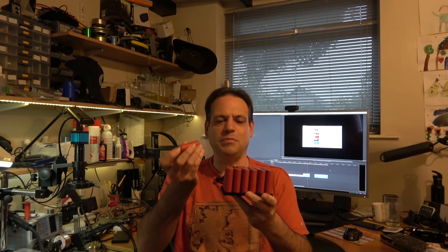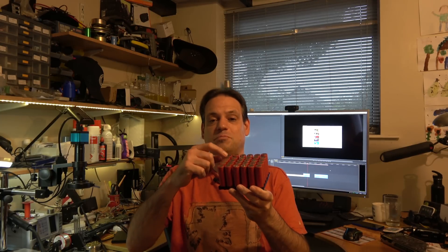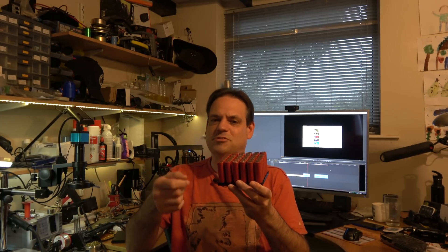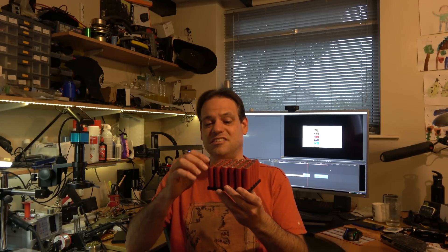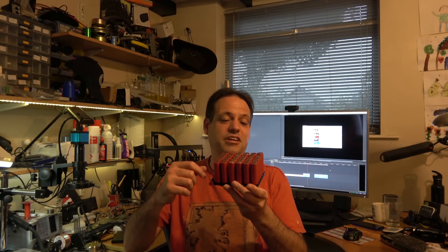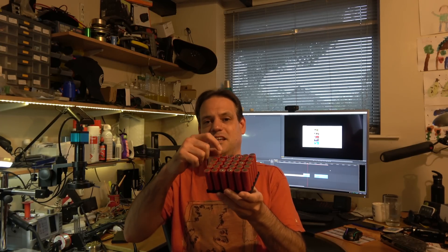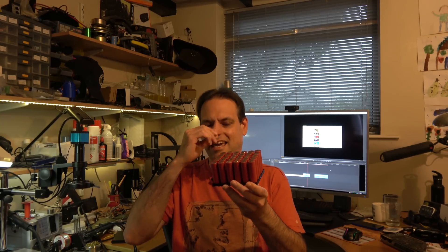Hi folks, it's been a while since we've had a proper project on this channel. For the last year or more I've had this set of lithium ion batteries kicking around on my desk, and I've been promising I'd make them into a proper 12 volt battery pack. By 'proper' I mean I'd spot weld the connections with nickel strips rather than just soldering bits of copper wire on, because although you generally get away with soldering, connections have a tendency to lift off after a while. It's hard to get the temperature just right, and supposedly heating up the cells too much can break down the little plastic separator between the layers.